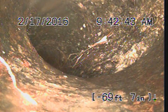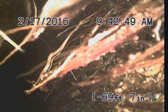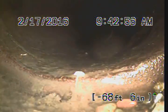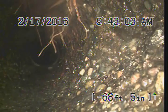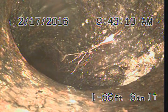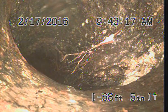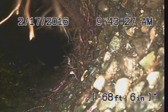Now we're in the cast iron — the cast iron transitions to concrete pipe. There's about a one-foot section of that right here. Does that look like the pipe has collapsed? It's not collapsed, but it's very, very worn — and it could collapse at any moment. See how you can see the aggregate that's in the concrete? That wall right there is very worn down — it's just going straight through the wall. So right here is where the cast iron ends. We can locate it now — that's what we're going to do. I'm going to turn this button on and stop the video.